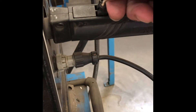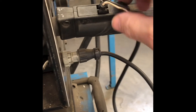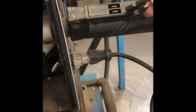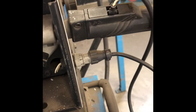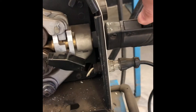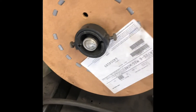Make sure this connector here is pushed down in there snug. If one of them backs out, you don't have no trigger — it's not going to tell it to do anything. This trigger tells the wire to start and it tells the gas solenoid to open. Now, looking back here, we've got to make sure that our wire is not coming off the top, that it's actually coming off the bottom — it feeds easier. Make sure your plate's on, your little cover pin here — that should be on also.